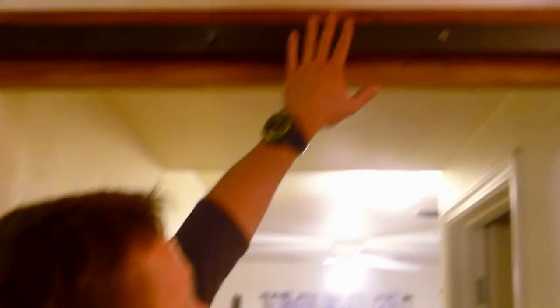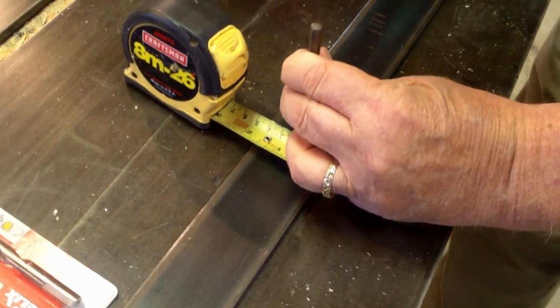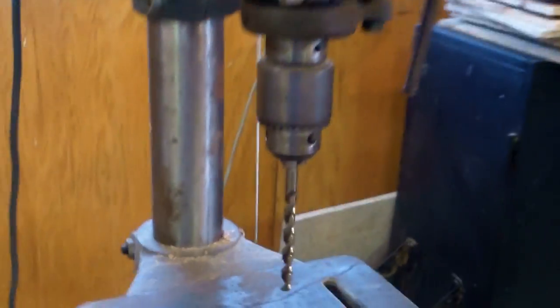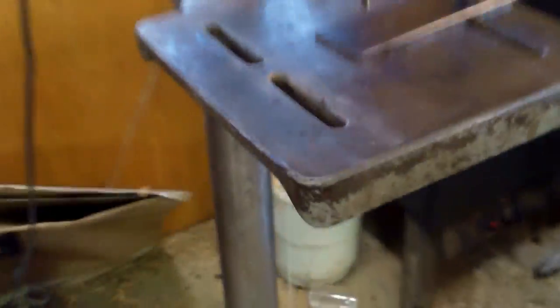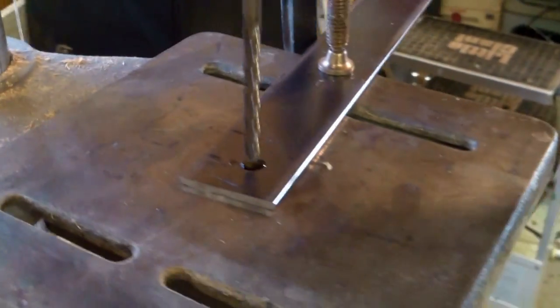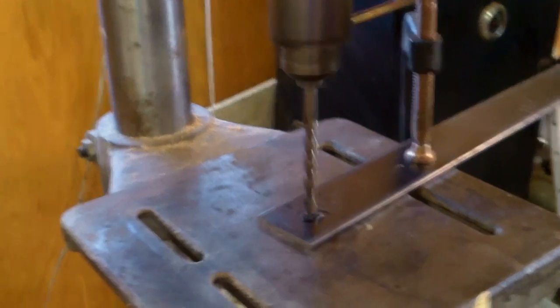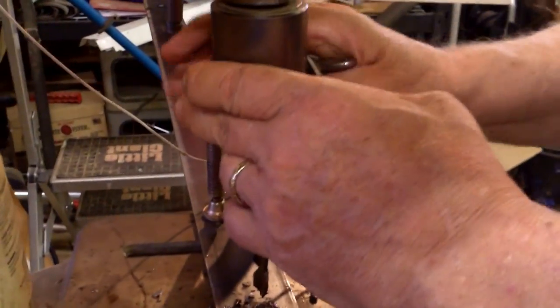Next, I'll show you how we mounted the track to our board and how we made the holes for the spacers. We're laying out the metal beam here. We're going to first do a punch to mark where we're going to make our holes, and then we're going to use the drill press. Starting with the 5/16 bit for the pilot hole, then we'll switch over to the 3/8. We've got this nice drill press to make our holes. We've got to clamp down and use a little oil. Then we swap the bit to the larger bit to finish off those holes.